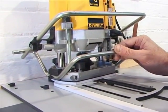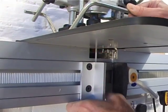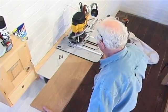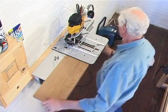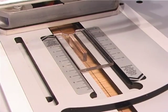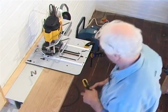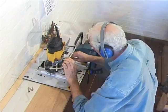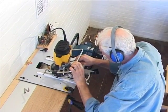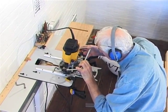Next, let's cut the picture of the cutter into a piece of acrylic. The socket is, of course, the size and shape and depth of the joint we are going to make, which is dead useful information. The position of the cuts is given by the Woodrat centerliner, which gives the exact center of the cutter. Clamp the wood to the plate and you're set up for the dovetail housing. Move the work to the next position and cut. That does the 2 trenches.